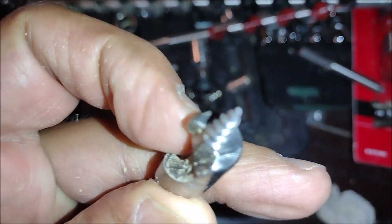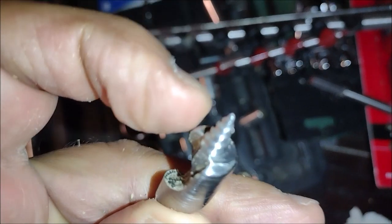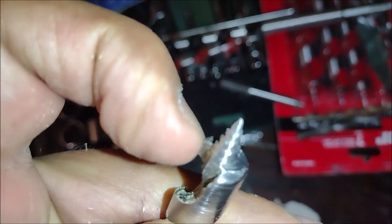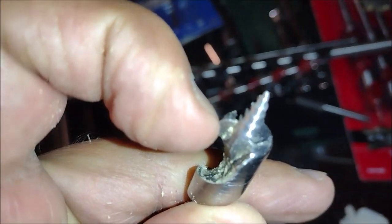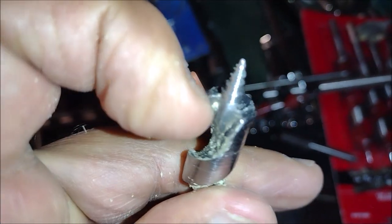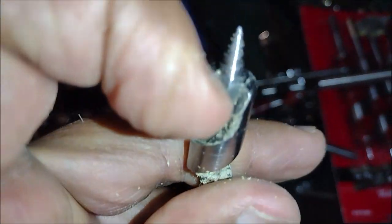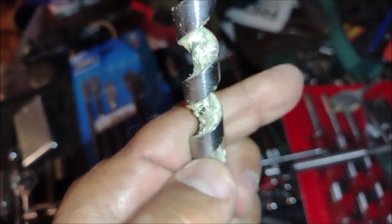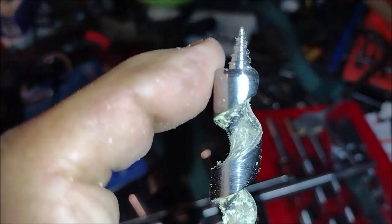It is dull. So when you turn this in the wood, it hooks. That screw will make it catch the wood. But then you start having burning, black charring because it spins. It spins, creates friction, but it doesn't advance. So what good is the rest of it? It is not good at all. You can say it just guides the debris out of the hole, but none of this is important in the cutting. The most important part in the cutting is the leading part.